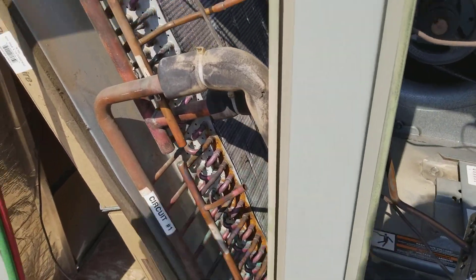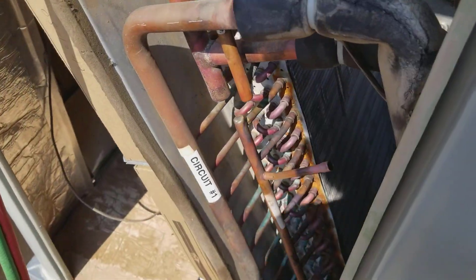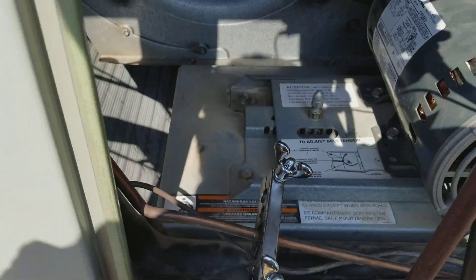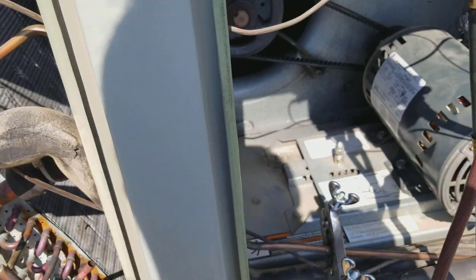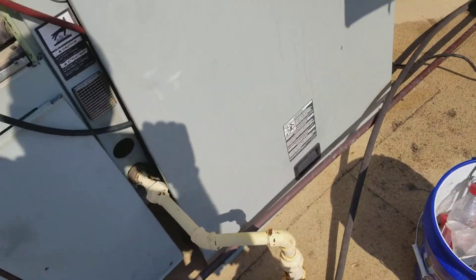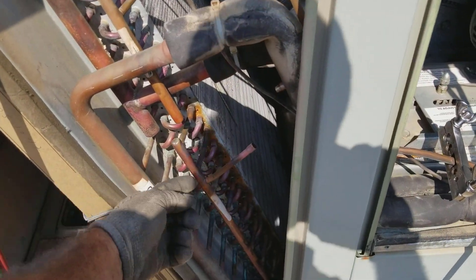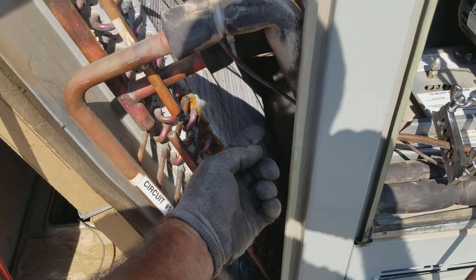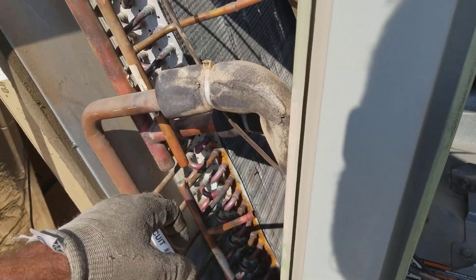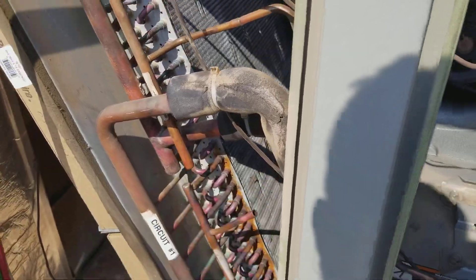What I'm going to do is I have my torch ready, I have the nitrogen hooked up. I unwelded the liquid line right here, and I have taken a pinch-off tool so that when I crank this nitrogen it should be ready. It should come back only this way and exit right here. So what I'm going to do is take my torch, preheat a couple of orifices, and then crank up the nitro and it should blow the debris back out right here. This has worked a couple of times.